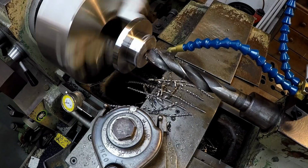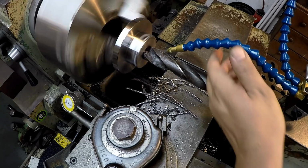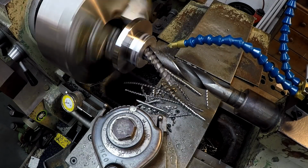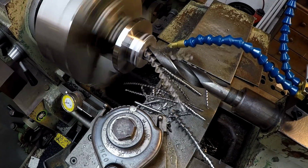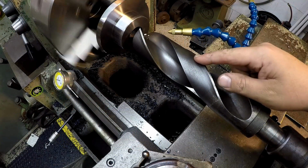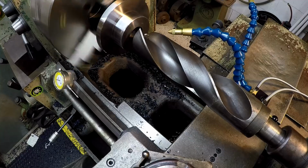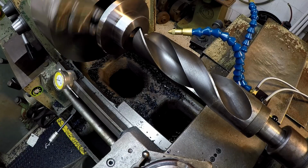Next up, we're going to use an 1¼ inch taper shank drill. So our final drill, this is a 2 3/16 drill bit, and that's going to put me a little bit under what I want the minor diameter bore to in these parts. I'll explain that later, the basic math of calculating what our minor diameter is going to be. This will give us approximately 100 thousandths to bore out of this thing right here.